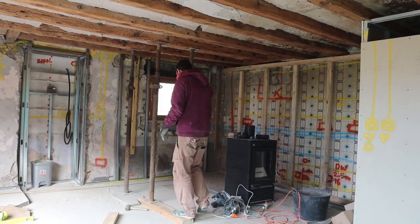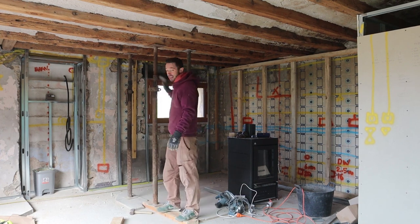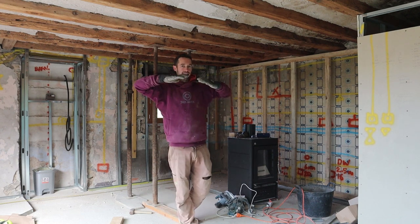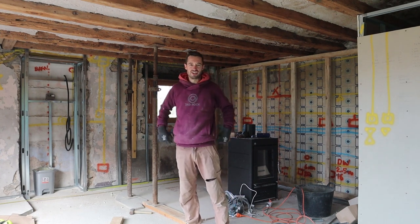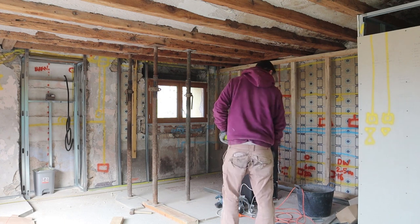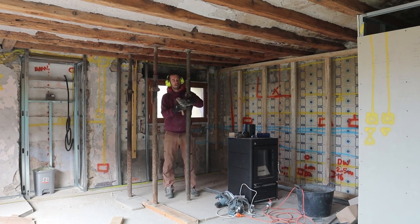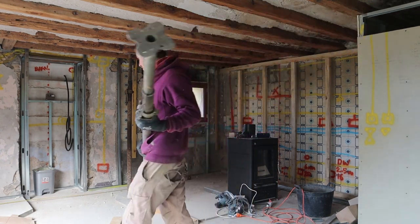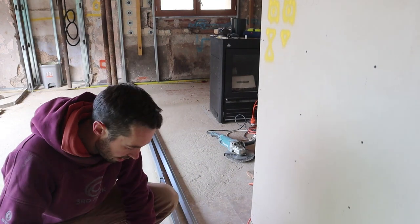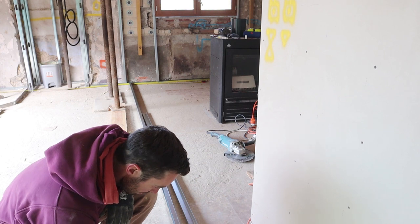And then I'm basically good. So where I want to cut it is where I've got this board. I'm going to put in another jack — take that one out. The reason I've got these jacks in is because I've got one and a half ton of plasterboard on the beams above here on the floor, and it all moves and breathes with weight changes. I just don't really want a drastic change after I've done it. So basically you tap this in place, take the other one out, mark out my line, and come right across the front of this unit. I'm going to mark on the outside of the line just using spray paint, and that will mean I just cut within the spray paint lines — that should do a pretty good job of helping me know where to cut.